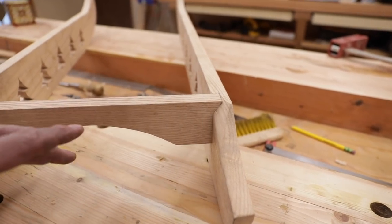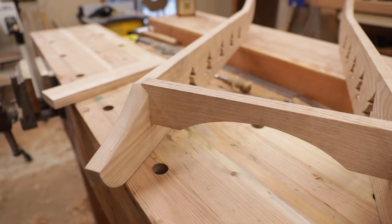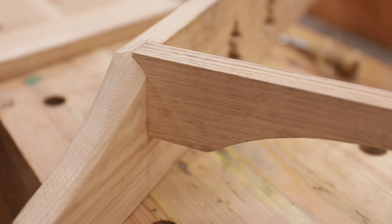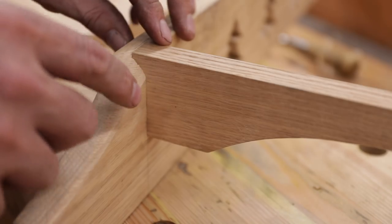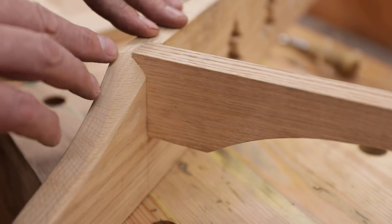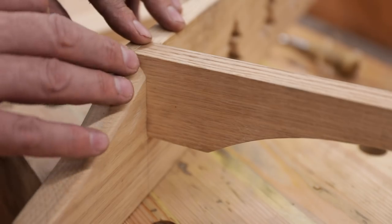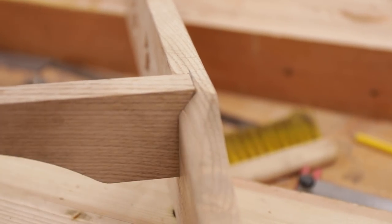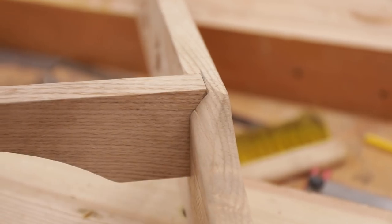This is the piece we're going to make together. The first one is done right there, and indeed that is going to go into a stopped dado. To be completely transparent, I made a terrible blunder — when I was chiseling this dado out I broke off the corner. The nice thing about wood is it's so forgiving. It actually turned out to be a blessing because it gave a design element that looks better than had it been square. I just took a hand plane, planed it down, sanded it lightly, and did the same on both sides.